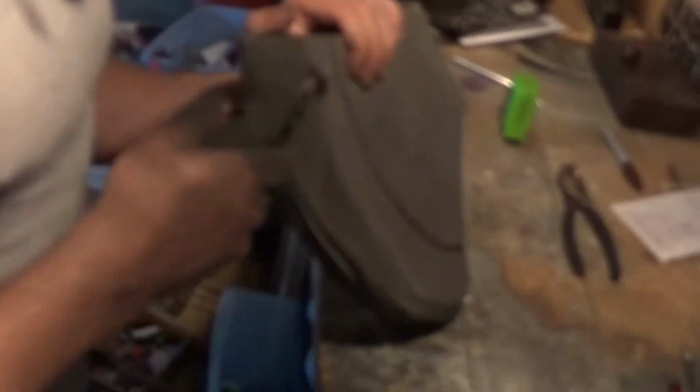Next, we cut apart the template so we can find out where the bevel is on the axe head. We also drew points on the side. Just like before, take it easy when sanding, wear a respirator, or do it in a well-ventilated area. And just remember, you're going to be taking off a lot of material, so don't be afraid to go at it pretty good.